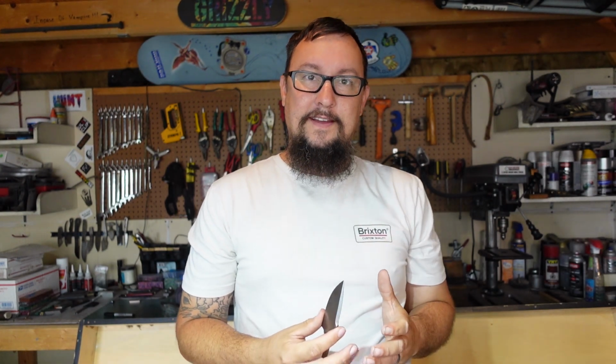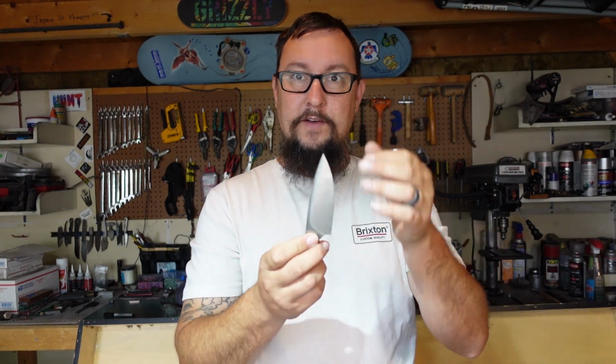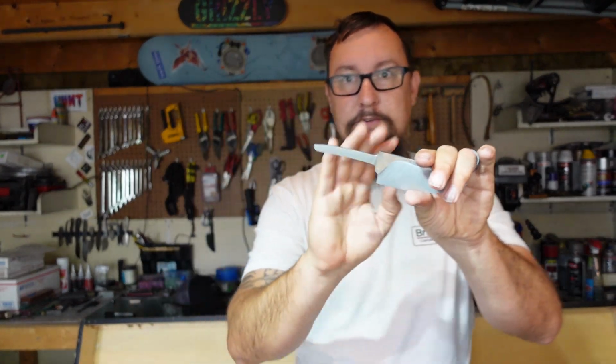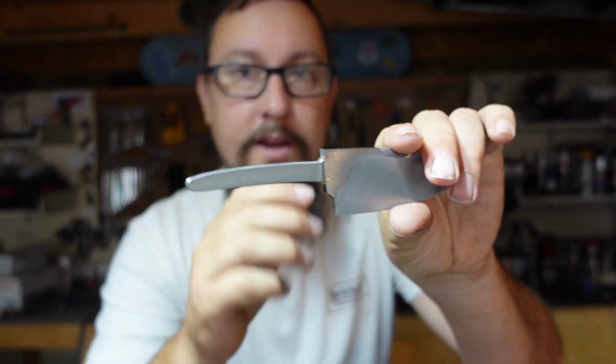Now in this episode, a few of the things that we need to focus on is getting the blade finished. So we started the blade last week, made sure we got our bevels done, our false edge, profile, everything that we needed to do to set us up for success on the hidden tang, little shoulders that we have right here, all those things. We did that last week.